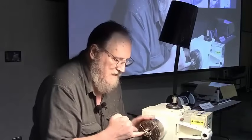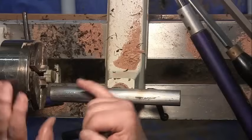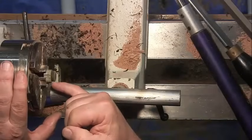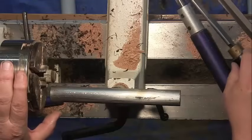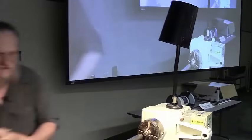I touched this shoulder with my tool when I was coming out — I like to have not much of a gap between my thread and the shoulder. So I sometimes touch this shoulder and have to retouch it, resquare it. Otherwise it won't sit against this surface. You have to make sure it's flat.